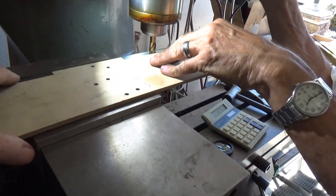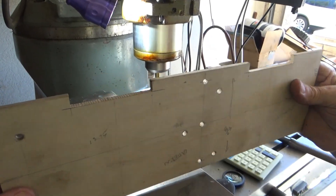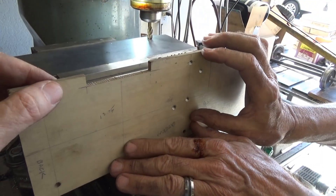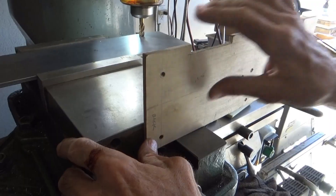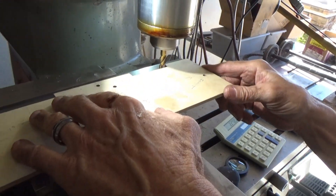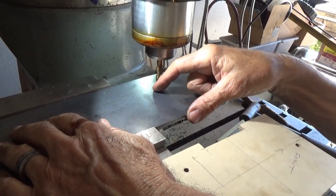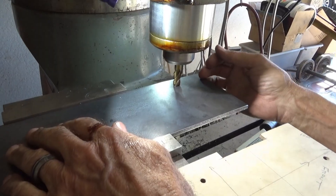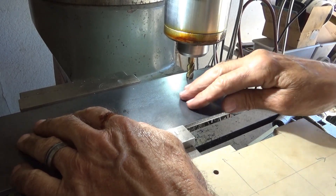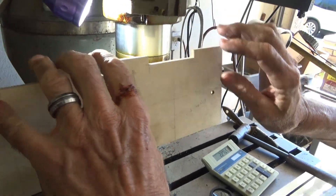Alright Bob, explain why we're not cutting it like this. If we put this in the vise, the vise base is here, where this metal would reside in the vise jaws, and as you can see we've got quite a bit of material above where the vise jaws would be gripping it. So that means it vibrates, it flaps around. By turning it this way, we're able to mill where we have the full width of this material acting as a resistive member as the cutter tries to push the steel this way. Of course it's cutting a pocket out, so that amount of load isn't extremely great compared to the other orientation, where it's trying to push that around and just keep deflecting that for every tooth — it just vibrates wildly.